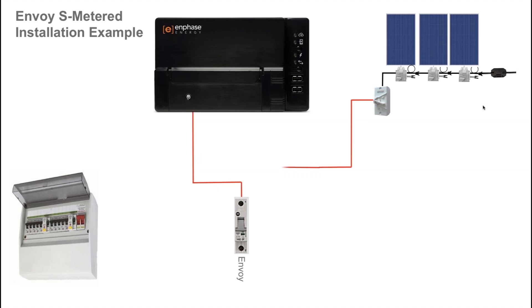From the engage cable you wire to a rooftop isolator and then an AC cable is run to your circuit. That circuit connection is fitted off with a 20 amp circuit breaker, which is the maximum current rating for all Enphase solar circuits that you run on a site.